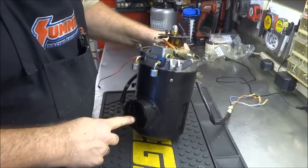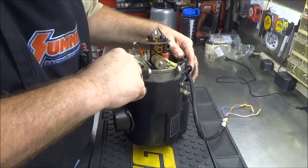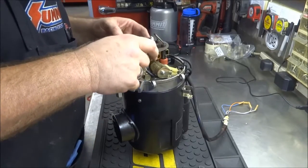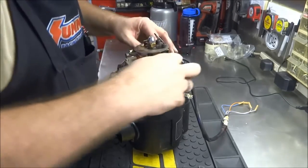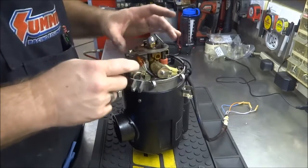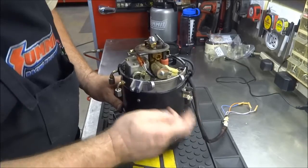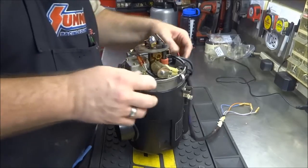Here's your fuel pump. This is the air intake. Here's your two fuel lines - you've got your supply line coming in here, and you can see down in here where you set the fuel pressure. Over on this side is the return. So what I'm going to do is pull these lines off, pull this disc off and the nozzle itself, the igniters, the fuel solenoid, and then pull the four screws to pull this inside disc up - that will separate it from the blower housing. This side is the combustion chamber side, this side is the blower housing.